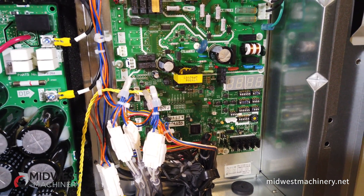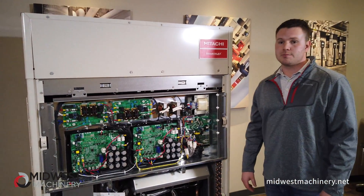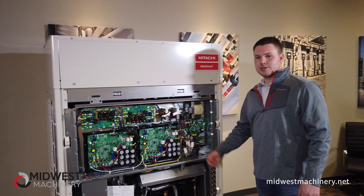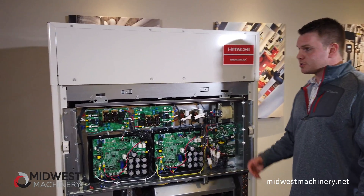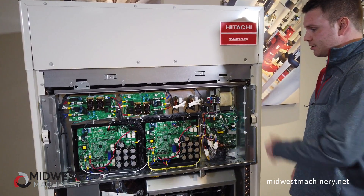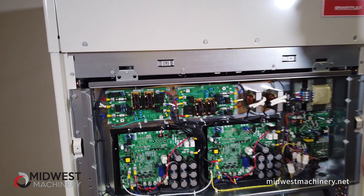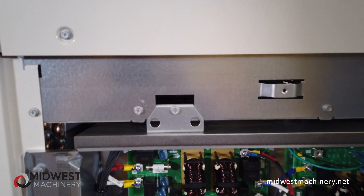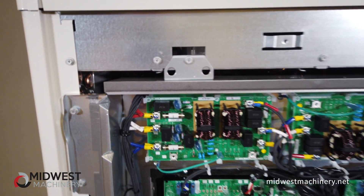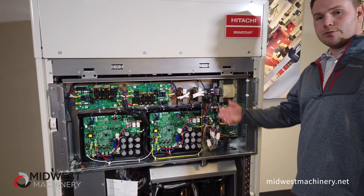I also want to mention that these are air-cooled but you're not going to experience any leaks — there's no refrigerant running behind them to cool these. So if you do need access to the coils or fan motors, you can just take your Phillips head out, remove the six screws, and take off this panel. All the screws on this unit are just regular Phillips, so it's quick and easy — everybody's going to have that tool with them. Remove the panel and you'd have access to your coils or the fan motor.